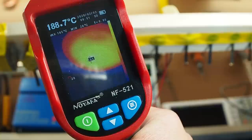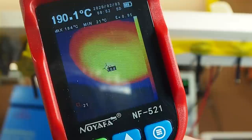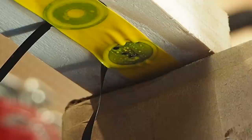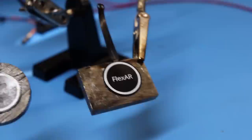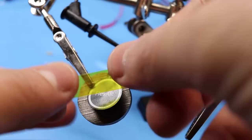It's actually burning up the electrical tape — the maximum temperature is 189 degrees Celsius. So our PCB electromagnet has a heating problem, but the concept kind of worked. The clip was also lifted with the steel core. Just to confirm, I tried powering a coreless sample with the same 10 volts, which the paper clip was not attracted to, and things started getting smoky — its temperature was rising to 275 degrees Celsius, around 85 degrees higher than the cored samples.